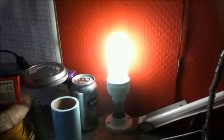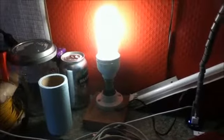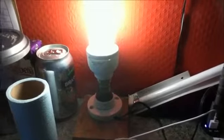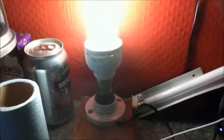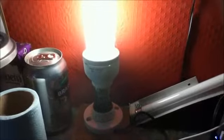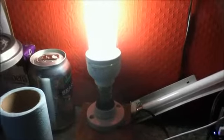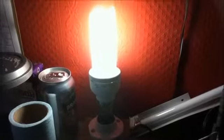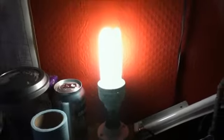Obviously you would mount your lamp socket on a wall or ceiling, or you could convert an ordinary table lamp by cutting off the plug and fitting a 12 volt plug. Just a note of interest here. With a bayonet light fitting, there are obviously 2 pins in the lamp socket, and these bulbs are polarized, i.e. they will only work one way round, so don't be worried if you pop it in your lamp socket and it doesn't light up. You have not broken it. Simply take it out of the lamp socket and twist it 180 degrees and pop it back in, and it should work fine. These bulbs are protected against reverse polarity, so putting them in backwards in the lamp socket should cause no long-term harm. So that is a 12 volt compact fluorescent lamp. I will just unplug it now.